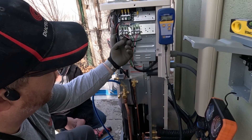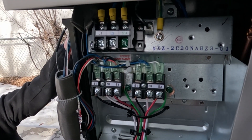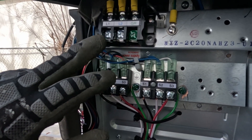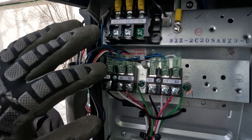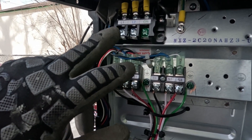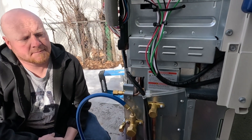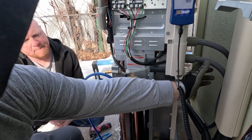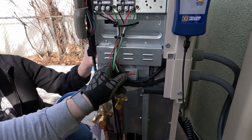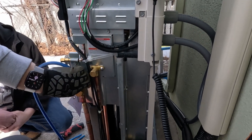See how I did all the connections? I like to zip tie them and make them look real clean. This is where you land your high voltage. All these machines are 220 volts or 208/230, whatever single phase — Ground, L1, L2. Real simple. I like to run all these in seal tight. This is a direct burial line, so you don't necessarily need to, but I think it looks cleaner.